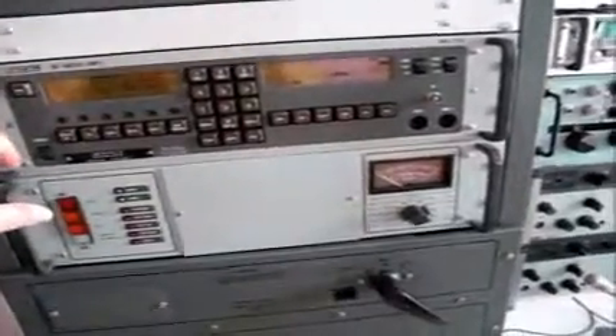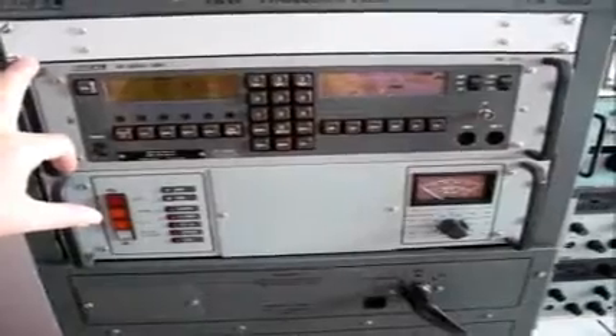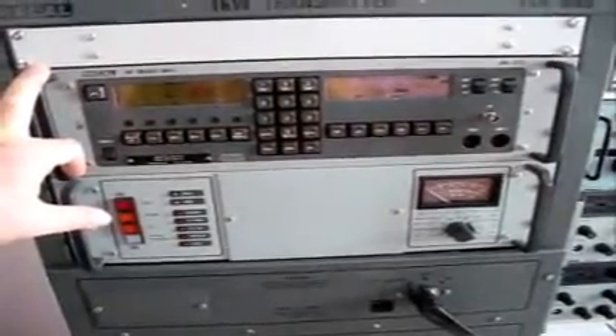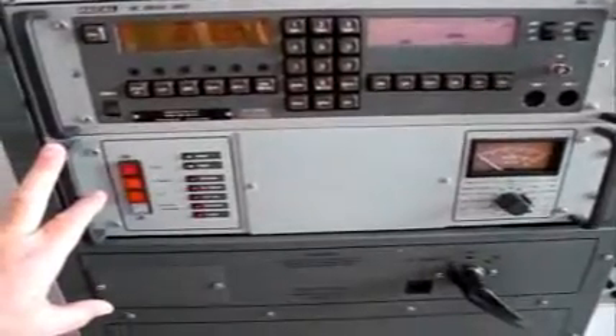The main unit is the drive unit — this is where the RF is actually generated, modulated, and basically is a low level transmitter. It's 100 to 200mW out. The unit underneath is the control assembly for the main 1kW.